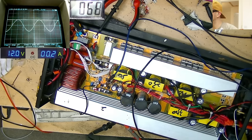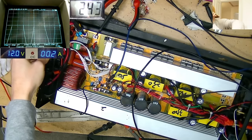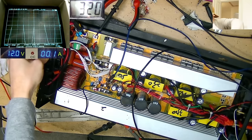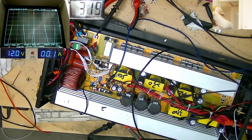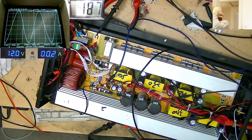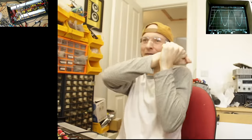So that was 200 volts. I've got to go another 100 again. This is so terrifying, guys. I absolutely hate it. I don't like it. Okay, there we go, it's fully on and staying on, woohoo! Okay, that was a lot of voltage as you can see on the multimeter. I'm just keeping the 12 volt supply side active now, just to allow the rails to sink back down slowly. Woo! Okay, I think we have a successful repair.